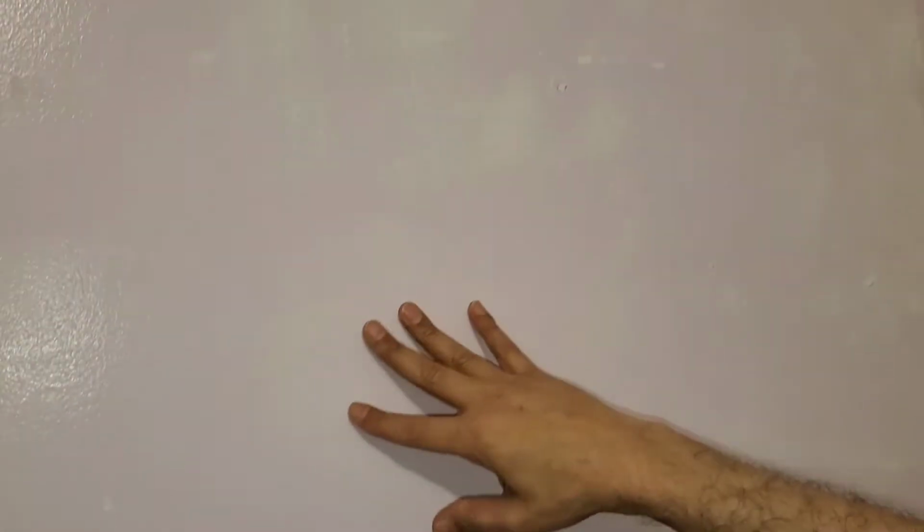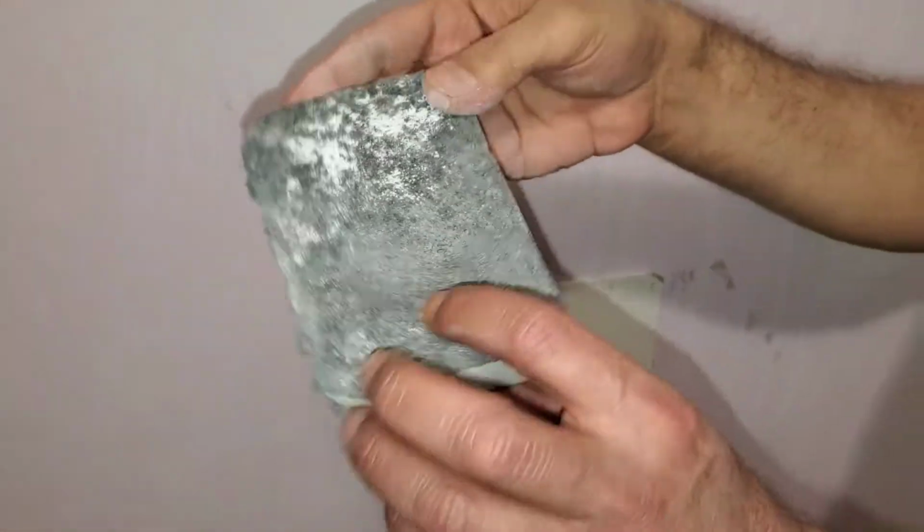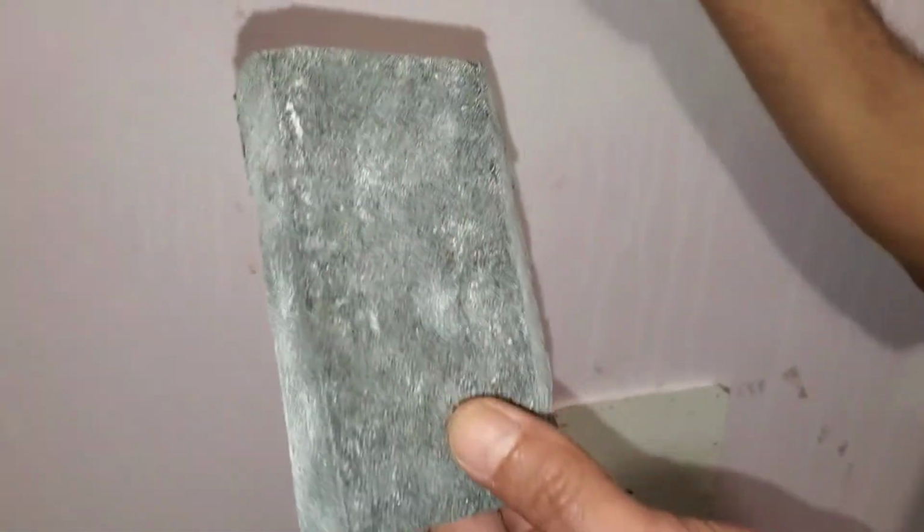And in a previous video, we also talked about applying filler, as you see here, to fill up the holes, cracks, damage, everything else. And to sand it, you have to go very easy, very light, just like that, see? You don't need to spend much time sanding. Very quickly, just like that, and it's done very quick. This is a sponge sander. It's really good for doing any type of job, and you can use regular sandpaper with a sand block, but this one is the most used and I like it so much. Here, same thing, see that?